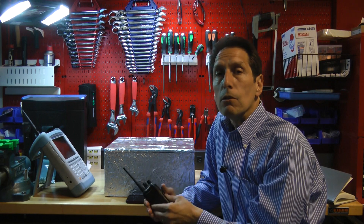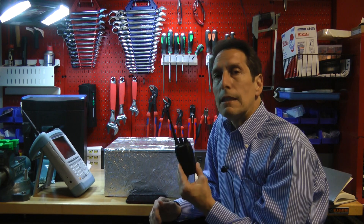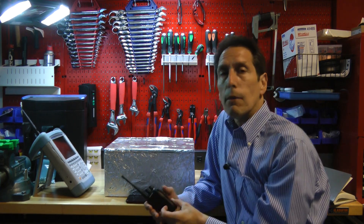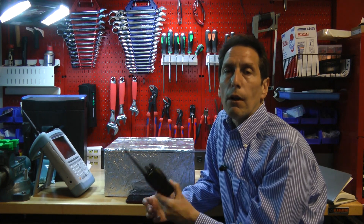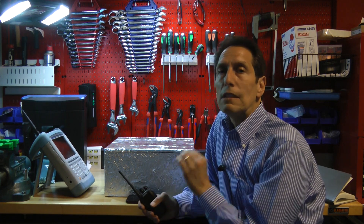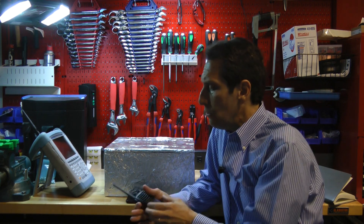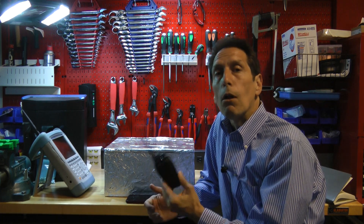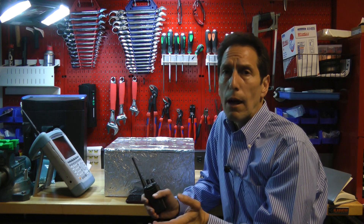Testing at about 470 megahertz is actually a great frequency to test at. The problem is that two-way radios transmit with way too much power. If I put a radio inside my box, I will easily be able to talk to the radio with another one, because there's just so much power being transmitted and the received circuitry is so sensitive — that way they can talk very long distances. There's no Faraday cage you would really be able to build that would block a two-way radio signal. It might take 120 or 140 dB of shielding, and that's just not practical to build.